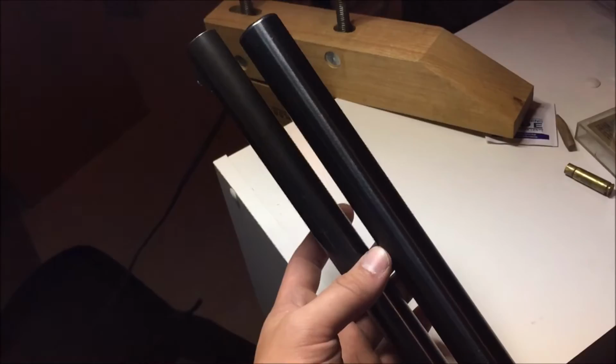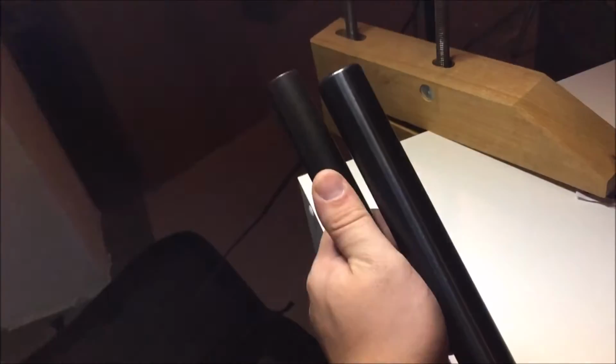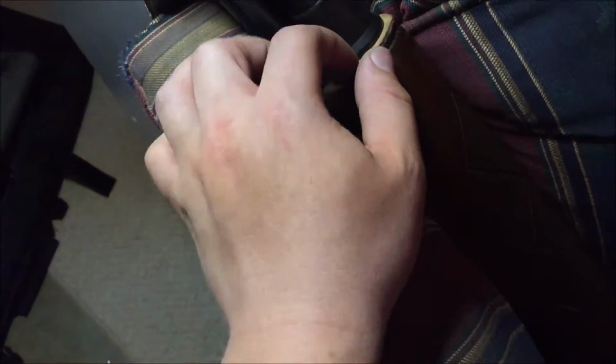Now I can't put the barrel clamp on it because this thing is a recoiling barrel. It's a full recoil system. When I put this on, I realized I had a 5/16 gap in between. So I took a chunk of leather and machined myself a 1-inch washer, because apparently they don't make any washers in that size. I sat there with my drill press and built myself a spacer. The reason I got the leather on it is to keep this thing from coming undone.